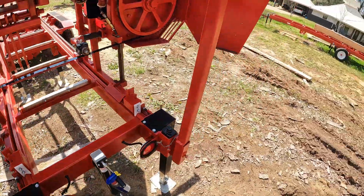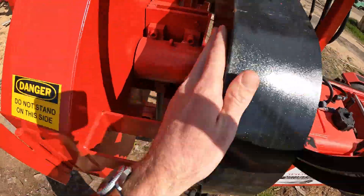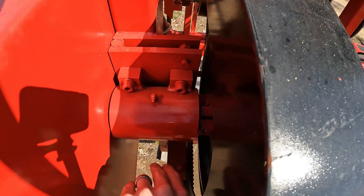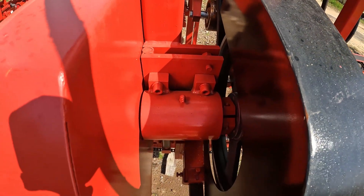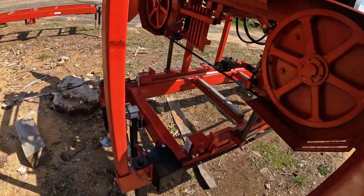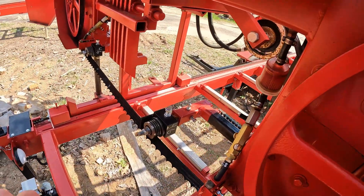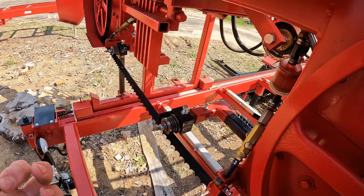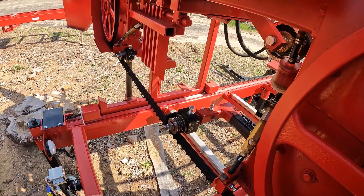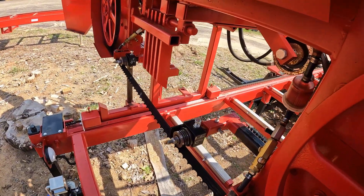Same adjustment on our idle side. Over here on the drive side, the belt guard has to come off, but I've got that same adjustment bolt top and bottom. It does make it easy to get to. That is not a common adjustment — if I'm changing blade width or blade sizes I might have to get in there, but as long as you're staying with the same blade, you shouldn't have to make that adjustment very often at all. But there are times we need to get in there and make that adjustment.